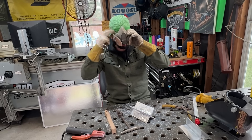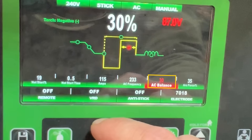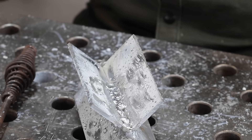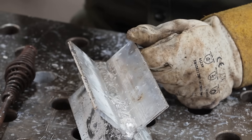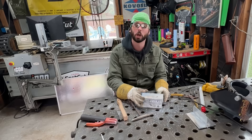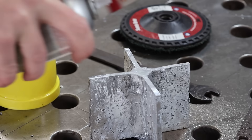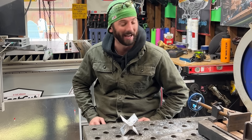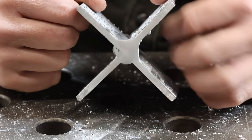What an absolute horror episode this has turned out to be. We just got done welding the AC stick. We've got our balance set to 30%, AC frequency at about 250. It honestly had the best of both worlds there — it sucked on DCEN and it sucked on DCEP. If you guys know any people that do aluminum stick for a living, we need to start a foundation because they need help. However, on our DCEP weld, we did get some solid inches on it. We're going to try to find at least a spot where we can get a decent cross-sectional edge and get some results. This was a wild experiment, and honestly I'm not super proud of any of the results.